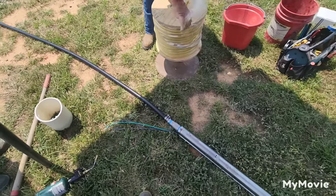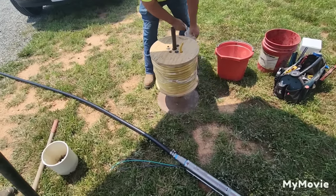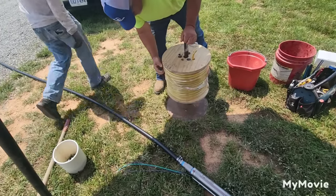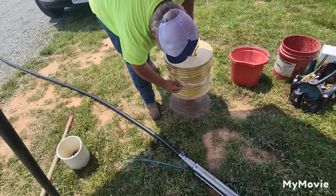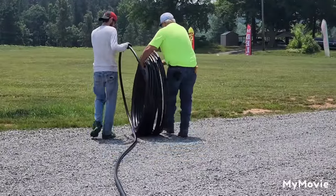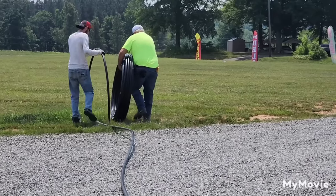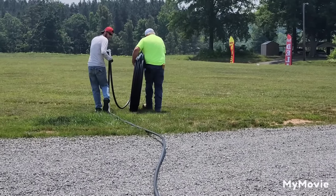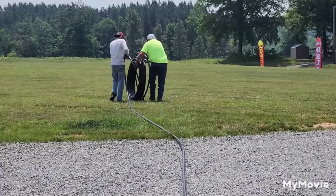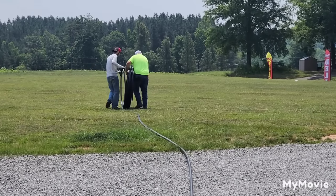Now that I've covered all the topics and all the pumps, we're going to drag out the wire. Since we know the pipe is 300 feet, we need about 305 feet of wire. When it comes to rolling out the black roll pipe, it really takes two people. If you notice the natural coil in the pipe — if you roll it out in the sunlight across the field, it will help heat up the pipe and take that natural curve out of the plumbing.